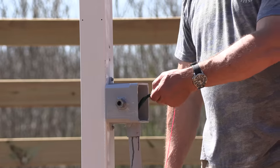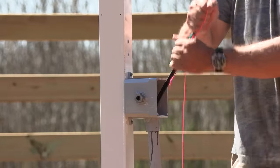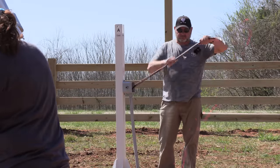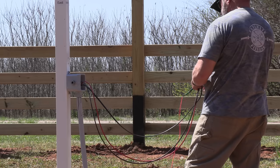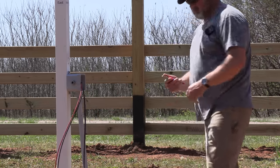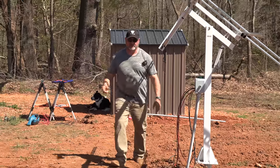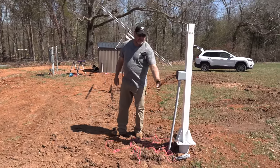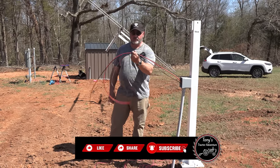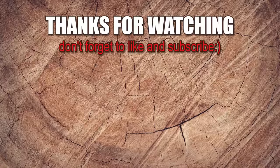We got the wire out on this end. I've got a lot of excess — I bought a lot of excess wire. That's more than enough. That took about 30 minutes to run the wire through this conduit, which would have been less time if I had laid the wire out first — learning curve. Don't put loose wire on a stick. We ran all the way through to the second conduit and got the wire hanging out. We're ready to move forward. I hope this helps you with running wire through conduit — we've done this from four-inch conduit all the way down to one inch. God bless.